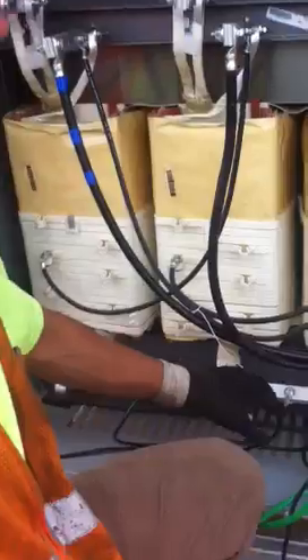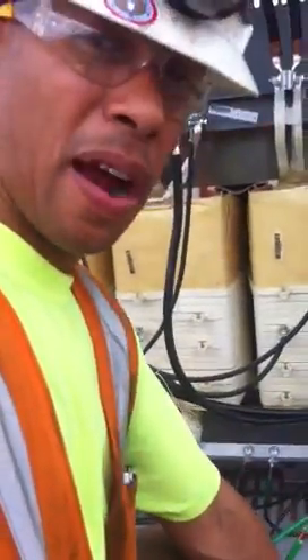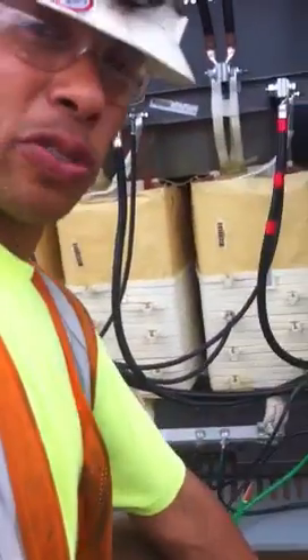But the main purpose here is to ground X0 and bring X0 to the ground rod. The first thing you do is bring in all the wires — all your ground rods go straight to X0, and from X0 you bring it straight to the ground rod, which is only one wire: a number six, or a number eight if stranded. The smallest wire you can have is a number eight if stranded. Take care — I hope you enjoyed the video.